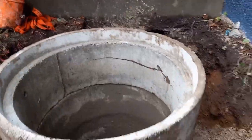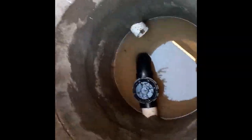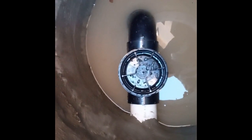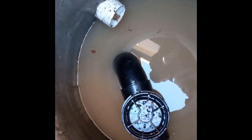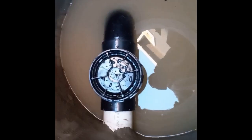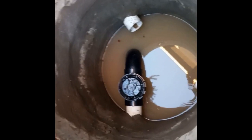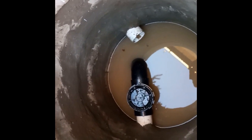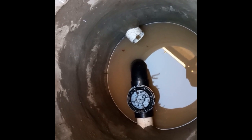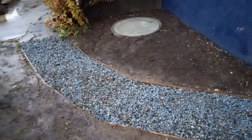Just put the lid in and backfill — and this is the finished sump with the backwater valve. That 90-degree elbow — called a street elbow — is to prevent floating debris from entering and jamming the backwater valve. Honestly, backwater valves rarely work properly in real life; they usually get stuck when water backs up. But I installed it because that's what the customer wants and what code requires. It's evening now, the walkway is cleaned up, and that's the newly installed sump.